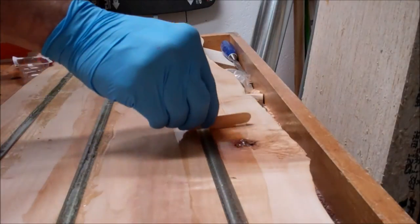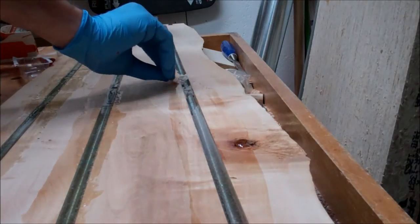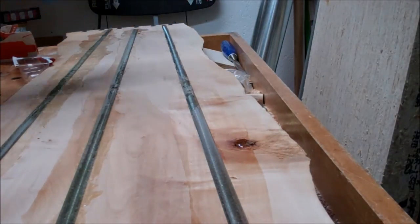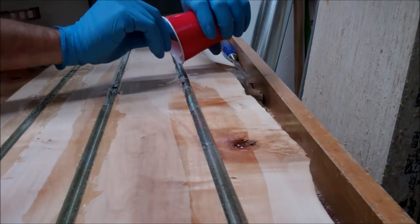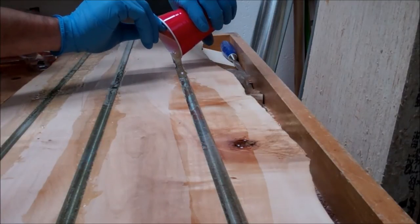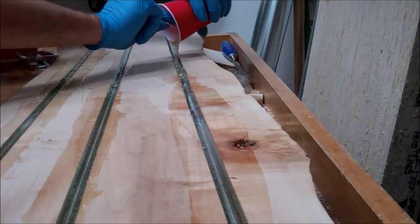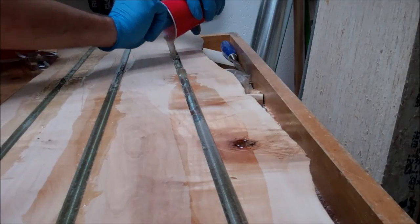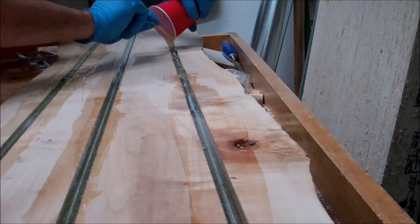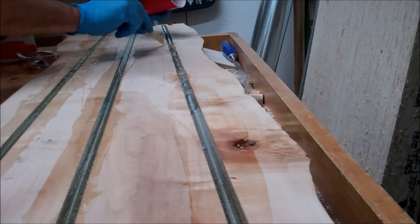I use the same stick to take the epoxy that rose up — because I had overfilled the slot — and just get a nice even mix on it. So any epoxy that rises up proud of the surface, I bring back over it. Then once all that has been put down, I take another mixing of epoxy and pour it over. What I've found is I tend to go for this application to be even with the wood, and once the epoxy dries it leaves a slightly concave surface, ending up slightly below the wood.